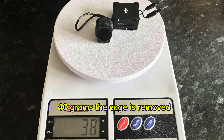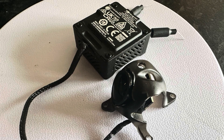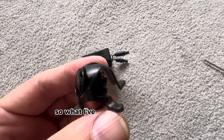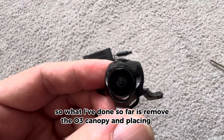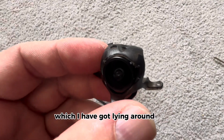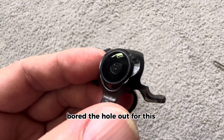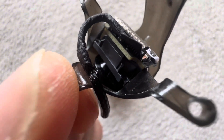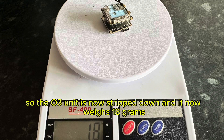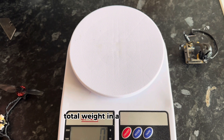At the moment this is 40 grams — that's with the air unit and cage. The cage removed comes out at 38 grams. Camera housing removed is 34 grams. What I've done is remove the O3 canopy and place it in my canopy which I had lying around, and bored out the hole for this camera to go in and slotted it in. The O3 air unit is now stripped down and weighs 18 grams. O3 air unit and camera housing all intact is 20 grams total.